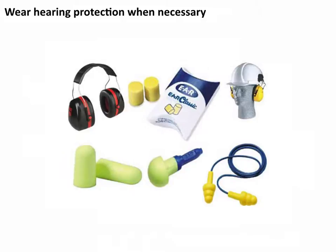Some processes in the lab or shop can be pretty noisy, especially when you're doing something like grinding. If you're grinding a thin sheet metal plate, it can vibrate and make an incredible amount of noise for such a small part. Your hearing is very easy to protect and very expensive and difficult to deal with the loss of, so you should wear earplugs. These foam earplugs are very cheap and widely available — you can buy huge packs on Amazon. There are also overhead earmuffs, which are also good options.